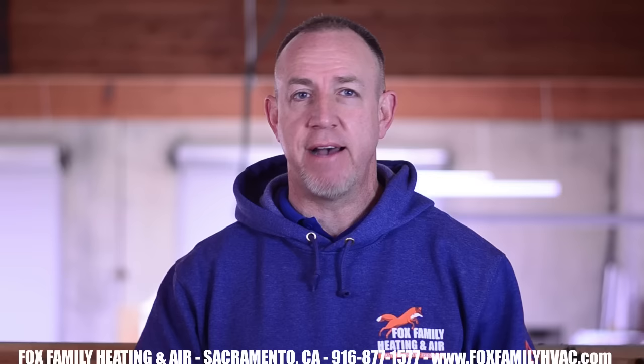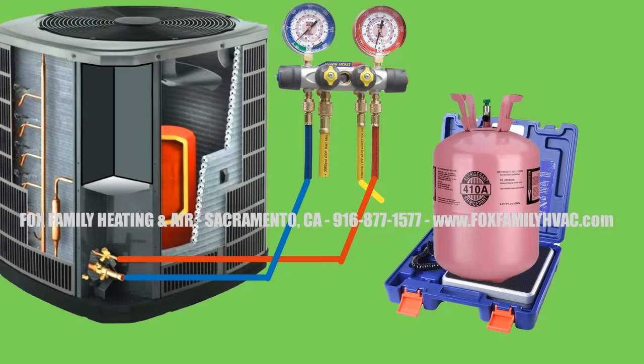You don't know for sure how much refrigerant is needed, but the customer should be aware it could be around 5 pounds — maybe a couple pounds more or a couple pounds less — but either way, we need permission to move forward. Using a scale is the only way to know for sure how many pounds of refrigerant you are adding. It's great to let the customer know you'll be using a scale too — it's reassuring for them and also helps prevent you from overcharging the system.